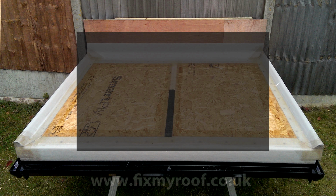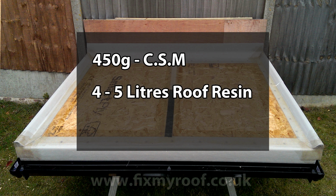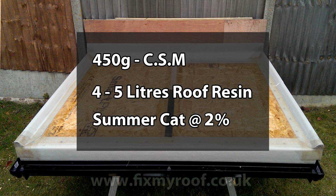Just for informational purposes, I will be laminating this roof with 450 grams c.s.m, which will require about 4 to 5 litres of resin, with a summer catalyst at a ratio of 2%. And if you need further information on any of this, please see the website links in the description bar or at the end of the video.